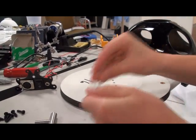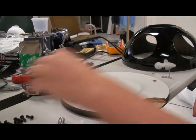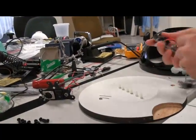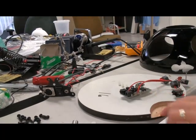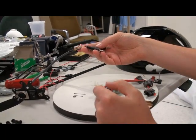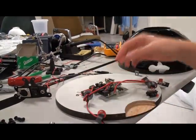First we take these plastic screws and push them under — all six of them. Then we add the spacers, which will elevate the amps just a little bit off the wooden board so that the solder joints don't get squished and things don't get overly pressed. Then we take the amps. For our arrangement we opted to position them this way because of the wire lengths — this is where we routed the connectors, and the audio connectors from the main faceplate will go into the three amps. Each one of these is stereo, and power comes in from this end. These lamps will be exposed so we can easily run the light pipe on the flip side, as well as relieve some room from the T-hook. These guys end up fitting pretty snug.